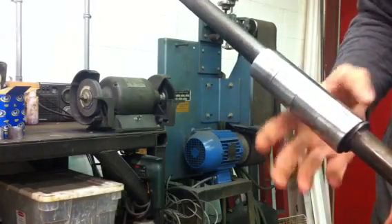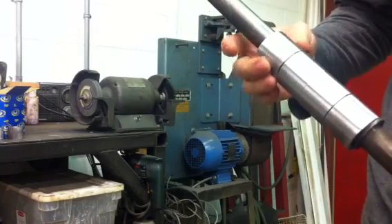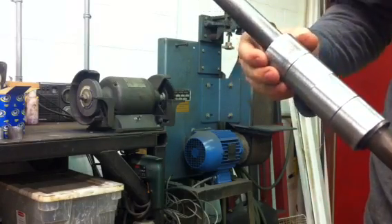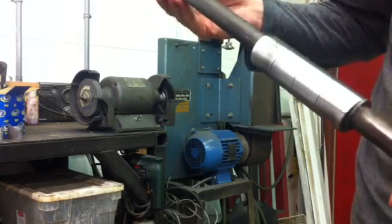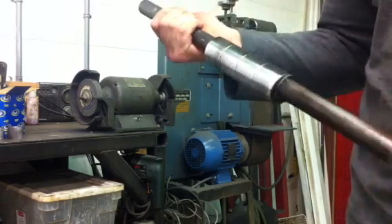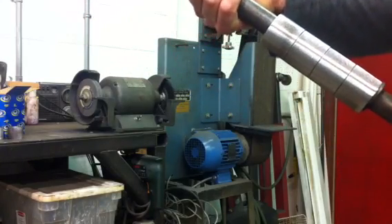And as they spin around, the belt sander wipes them clean. It doesn't really take off any of the diameter — it just cleans it up so it's nice and clean to TIG weld. I hope you can use that little tip when you're welding your own parts up. Thanks for watching.